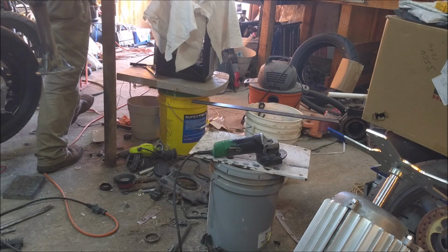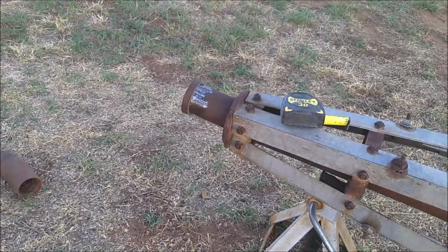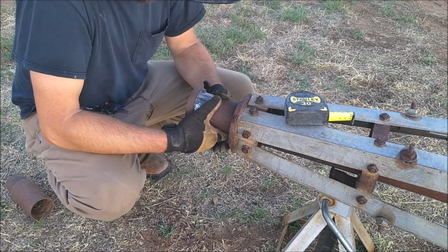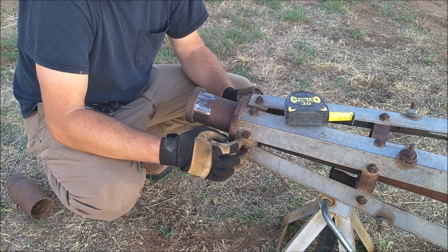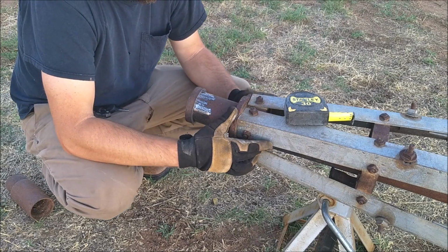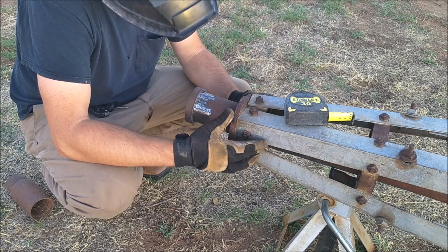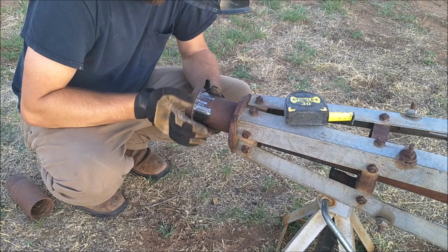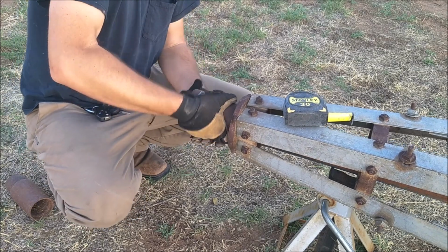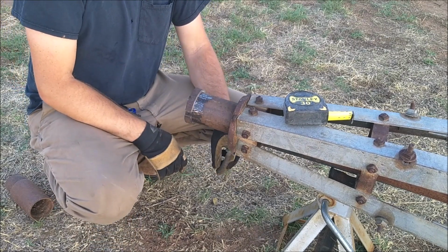Okay, got one more thing to do. Like I said earlier, this coupler fits pretty good inside this collar on top of this Fisher. It's a Fisher windmill. Anyway, so I cut a small coupler out of 3-inch casing. We slotted it so it would expand a little bit and hammered that boy on there.